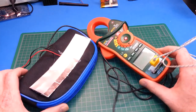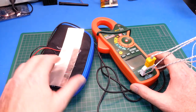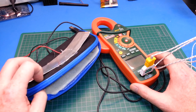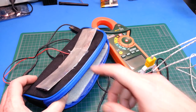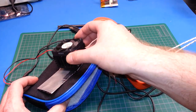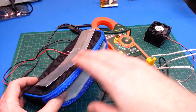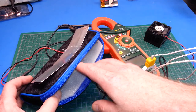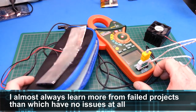So, final update on this video guys: I lost the footage, but this didn't work as intended. It worked, but because of the lack of a thermal break between the two sides, it ended up reheating through the limited insulation. So what I'm gonna do is add the fan setup on the Peltier, and then we should be back in business. The passive system didn't work with this insulation setup, and I want to keep this as simple as possible for now.